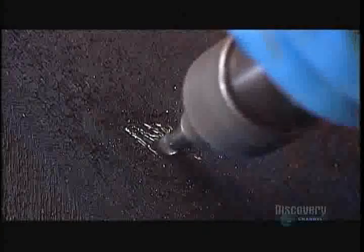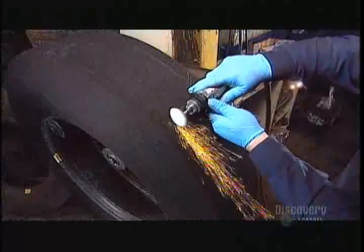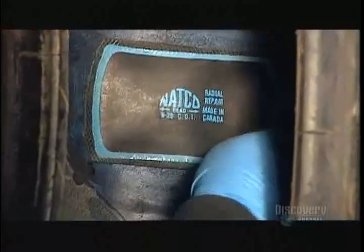Now, using a drill, workers remove dirt and rust from each spot. Then they work the area some more with the grinding wheel so that the rubber they'll use to patch it will adhere properly. They glue the patch from the inside with rubber cement, pressing out any air bubbles with a roller to ensure full contact.